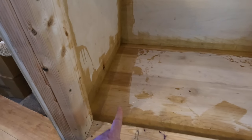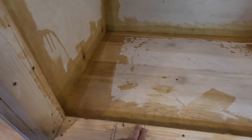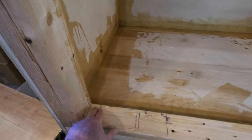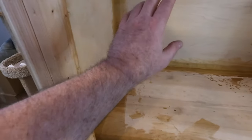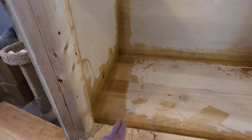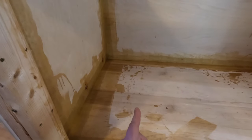Because we're doing an internal wetlands filter, what we're gonna do now is build this section out from the side, and we're gonna build the first baffle out. And then we're gonna get this structure built in here, so this will be all covered, and then we'll put in the baffle. And the reason we do half of the structure first and then the baffle is such that we can drill through to connect the baffle.